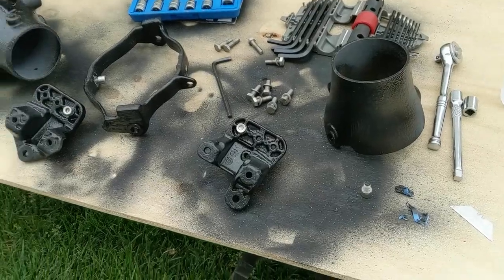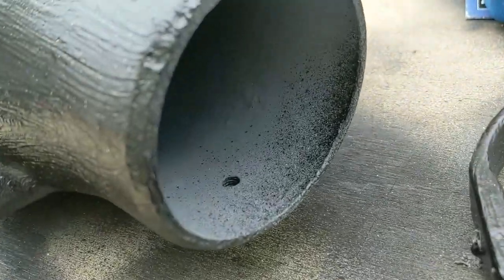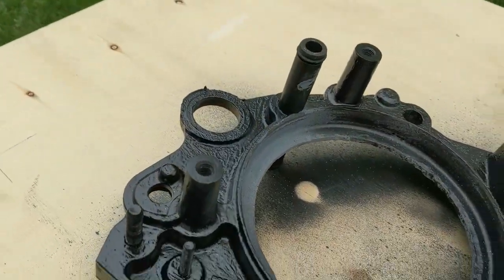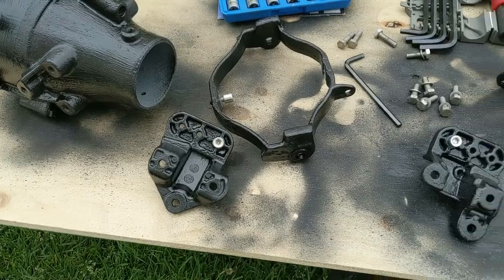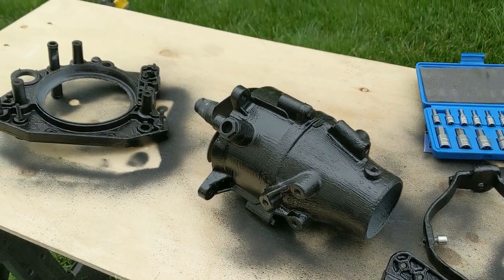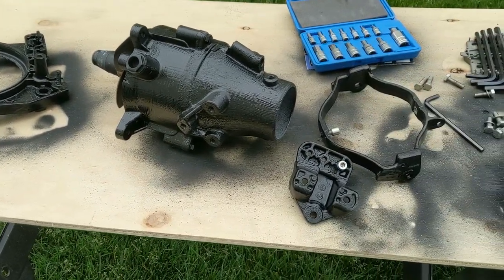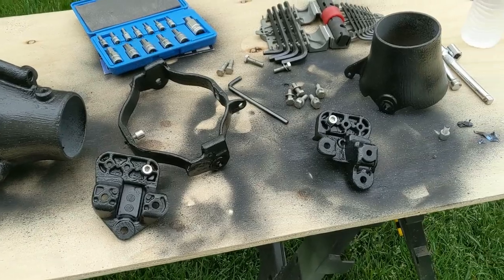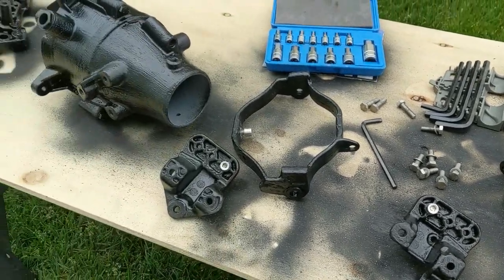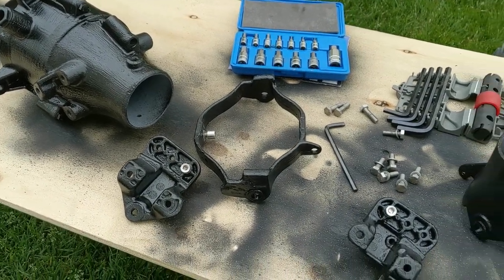Alright, so the pump is painted, and I'm getting ready to put it all back together. I didn't paint it to look good. That gray stuff is an aluminum epoxy primer. It's a two-part thicker type of paint. And the reason I did it was that it had some pitting in it because the first owner of the Sea-Doo left it in brackish water in the Chesapeake Bay area. So it had some pitting, and I just wanted to make sure that that oxidation was sealed so it wouldn't continue in fresh or brackish water where I'm going to take this. So I did an epoxy coat on it, and then I just quickly spray painted it just so it wasn't the gray color. So I fully expect a lot of this to wear off and get dinged up, but hopefully it'll protect it for a while.